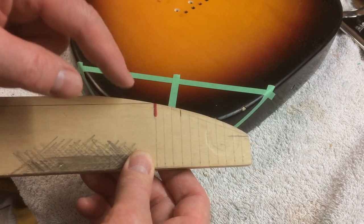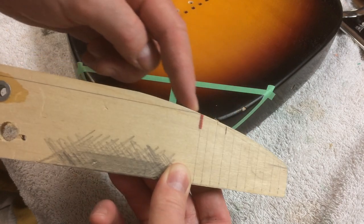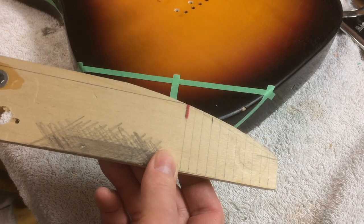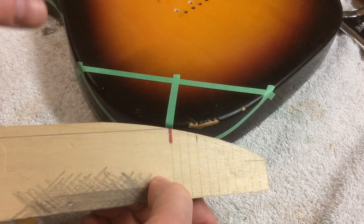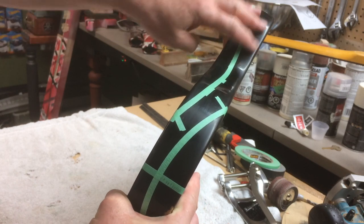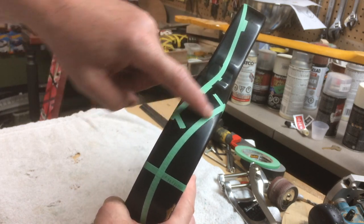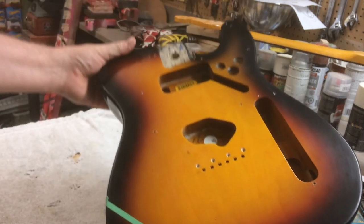One concern is that this is a poly finish he's not stripping, and there's also a veneer on the body. If we taper the armrest off to nothing, you'll have a messy wide area where you go through the poly and then the veneer. So instead, we'll bring it up and then stop with a definite hard edge — it'll look a lot cleaner. Once you're happy with both contours, make sure the relationship between them looks consistent — nothing sticking out at a weird angle.